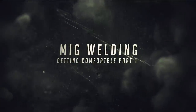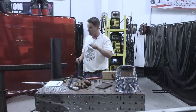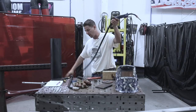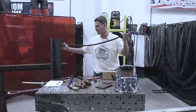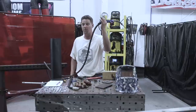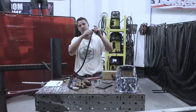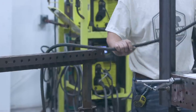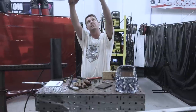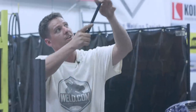This is for overhead and vertical welding — even flat. You've got this MIG gun hanging upside down or welding vertical, all this weight coming off it. Take a horse or a chair, throw it over there — that reduces half the weight off your shoulders. You're going to get more comfortable, weld further. They also make lighter aluminum liners instead of steel liners. And if you can't reach, get a big enough ladder so you can be comfortable.